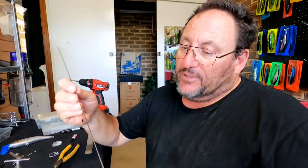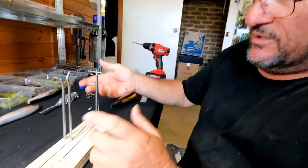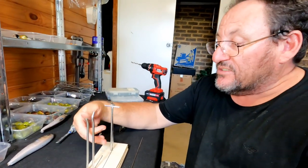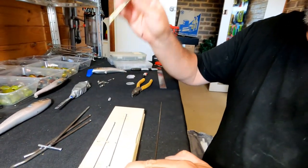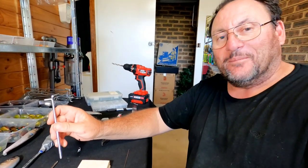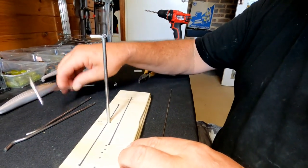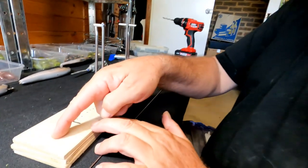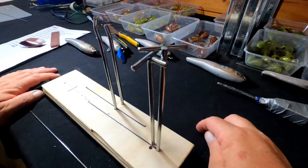To bend the wire the same way every time, I made myself a little jig. The big secret to doing these successfully is making sure all the pins come out of all the holes — if they don't and you start bending, you'll end up with a tangled, useless mess. Whatever you do when you make one of these, drill the holes so all your pegs slide in and out, especially when you're doing a wire with a V in the middle for the bottom hook hanger.